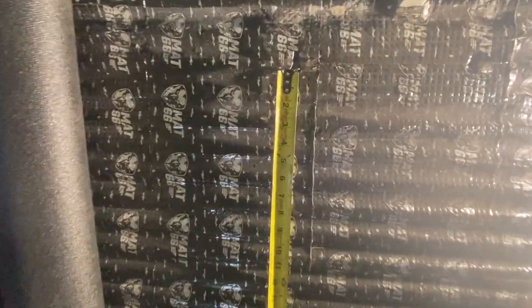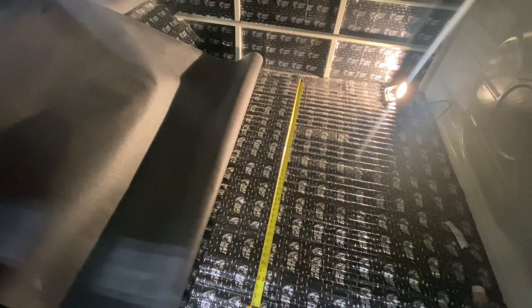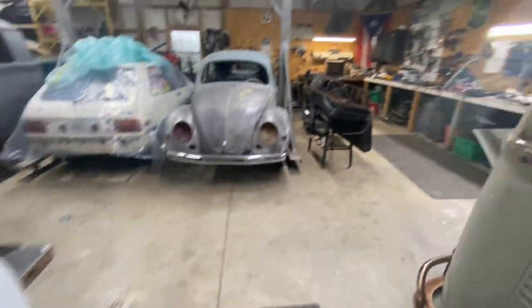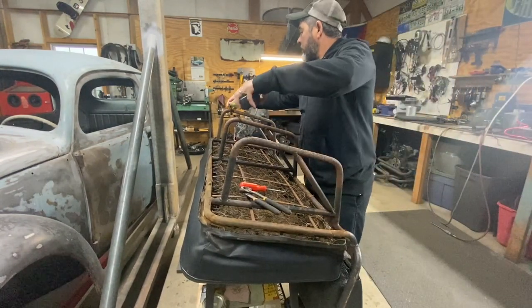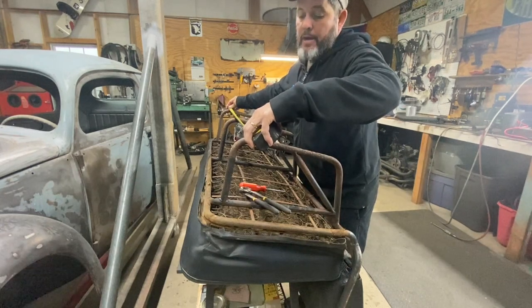What we're going to do is take the measurement from the center of that opening — that's where the clamp goes. The clamps are really expensive and it calls for only four clamps, not six. The bay window comes with six, this one comes with four. According to the documentation it says 35 inches, so the center of the two outside mounting legs needs to be 35 inches apart, center to center. Right now it's at 37 and a quarter, so we have to move it two and a quarter inches.